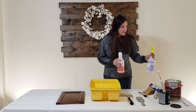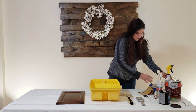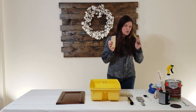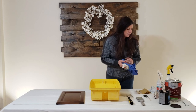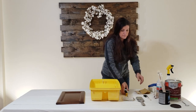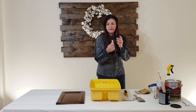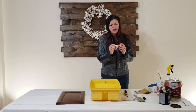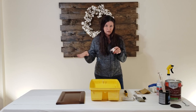Make sure you have a water bottle sprayer - the bottle will tell you how to mix and how much you need. You're going to need some sandpaper, either 220 or 240 grit; we're using 220 today. You need some gloves, a couple of rags - one for cleaning and one for the glazing part. You'll also need a roller, a paintbrush, and a foam brush, which you can get at any local hardware store. I like to use risers to lift the cabinet off your table.